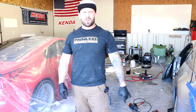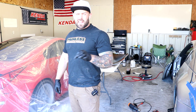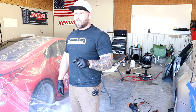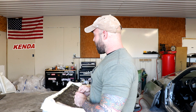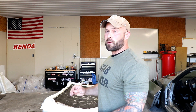Half of all the times I should have worn a respirator — that was it. That just atomized all the resin, so that's probably not a good thing. I'm going to let that cure, probably hack my lung out, and then we'll start laying the fiberglass. We're going to do two layers of cloth and one layer of mat, and it should be good. I didn't show laying down the fiberglass because it's exactly the same as before — one layer of cloth, one layer of mat, one layer of cloth. It's not extremely strong but I don't need it to be; I want flexibility more than anything. It's cured and I already popped it out.